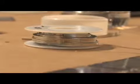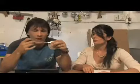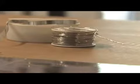There's basically three different things that you need for this. You need tabbing wire, which is a thin wire that's got a deposited metal on it. This actually solders to the cells. There's also a bus wire. It's basically the same thing as tabbing wire, but it's a lot thicker, so it handles more amperage, and you use this to tie your strings of cells together. There is also some silver solder, which basically you use to enhance the soldering joints.